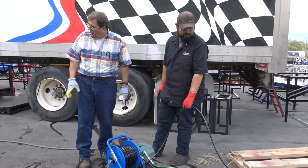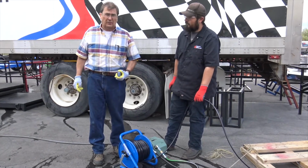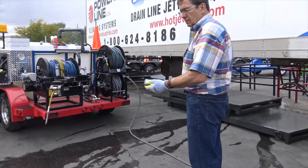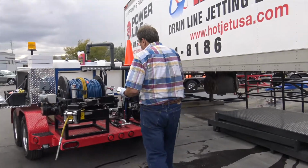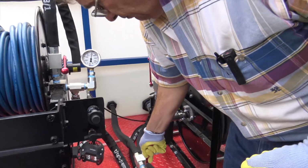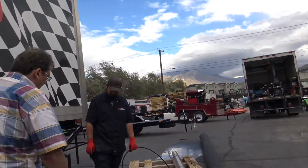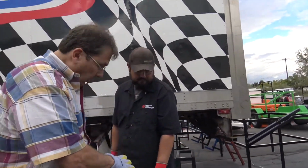Okay. Now, after you've done jetting, let's say you're doing a floor drain inside of a property. Let's say you're done with this and you shut it off. Keep in mind, you're still under pressure. This is important. It's one of our safety training. Listen to this. Okay, now he's going to relieve any extra pressure by pushing down on that.